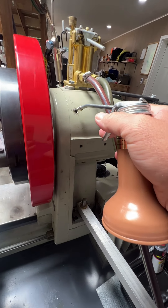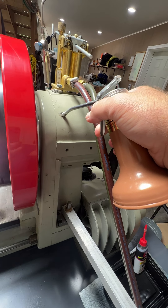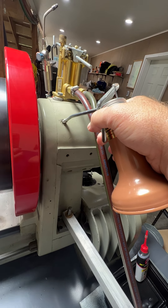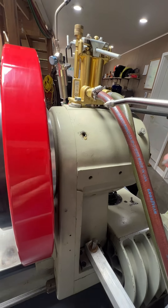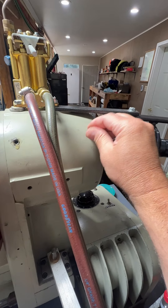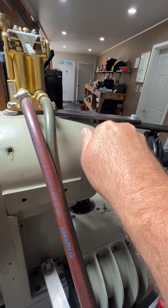I've got my Vactra oil in here, so while the lathe is running I'd like to give it a couple pumps. Wait till it's oozing out — there we go. Then you've got these covers, and a little zerk fitting that just unscrews.